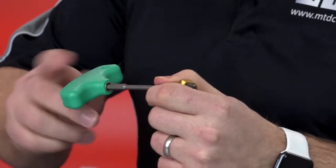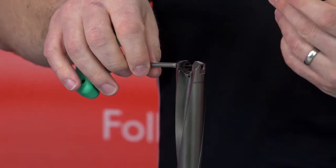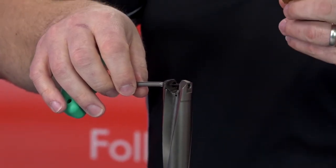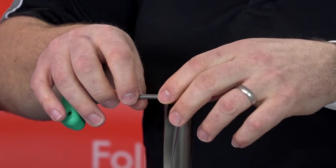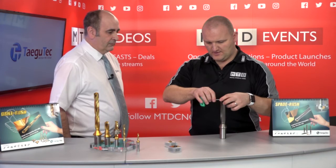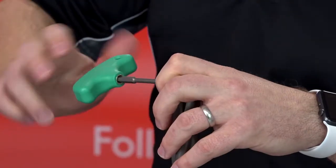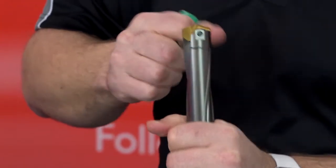I notice this body isn't coated. Does that mean there's any performance difference? It's not the same issue when you get to a larger diameter hole. The smaller diameter holes, it's critical to get the swarf out. Because of the flute we have in these drills, there's a lot of room for the swarf to evacuate out of the hole. It's a very clever system on locating the head into the body and you don't need to remove the screw entirely.